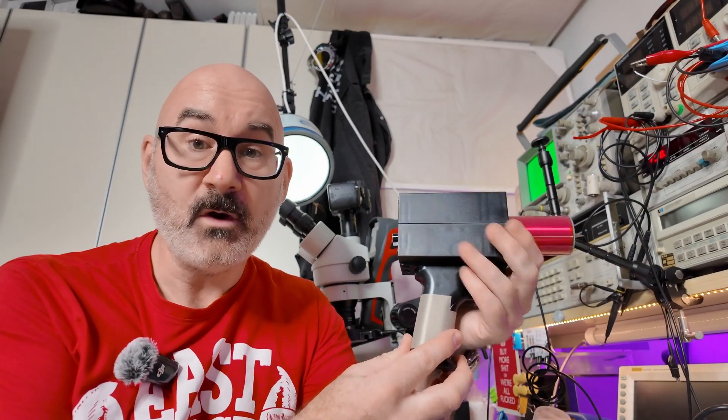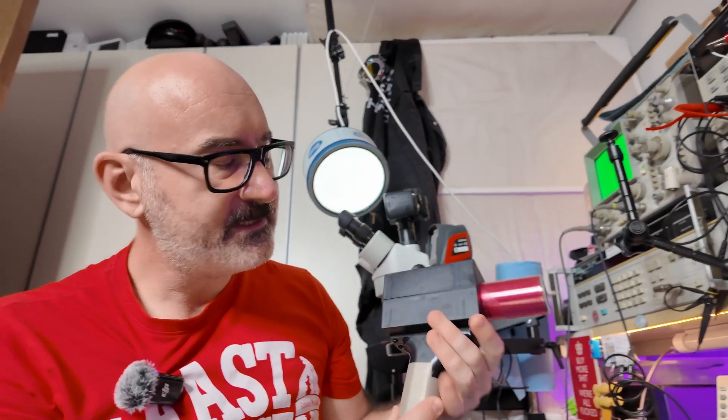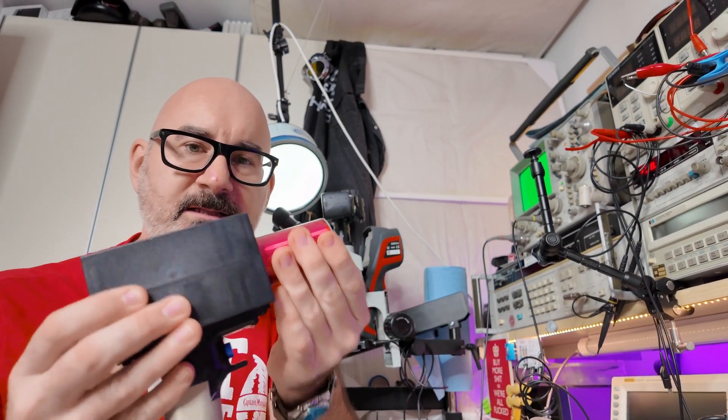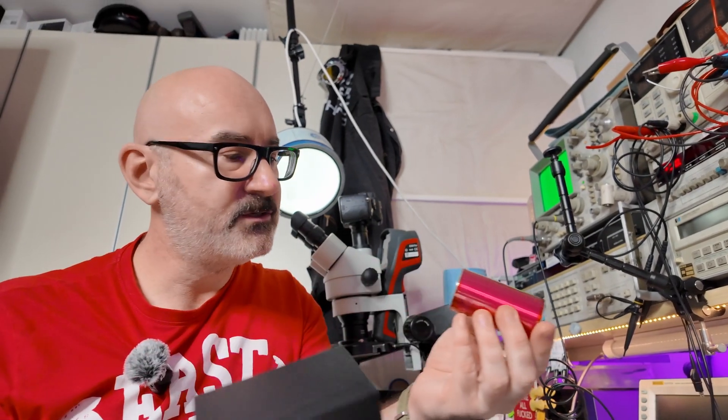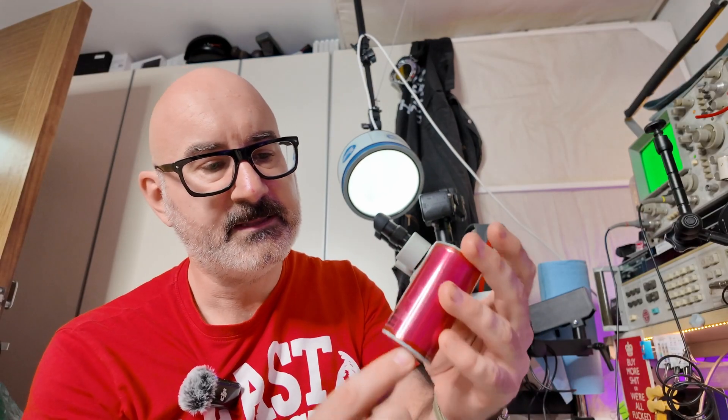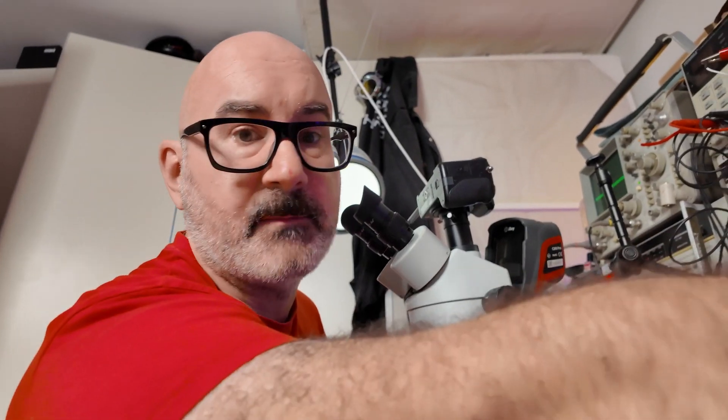We're going to stick to this today. How does it work and what is it? Well, you can see it consists of a box which has got some electronics in it. And this thing here, which is called a secondary coil, which as you've received it will be unscrewed. So all of that is like a sort of toilet roll, isn't it? With a lot of wire. Have a look under the microscope here - there's a pound coin for scale. So we can actually see how tiny and long the wire is. We've got 600 turns of 0.12 millimeter wire, and all that is connected to a little metal ring at the bottom and a spike on the top to give somewhere for the sparks to come off.